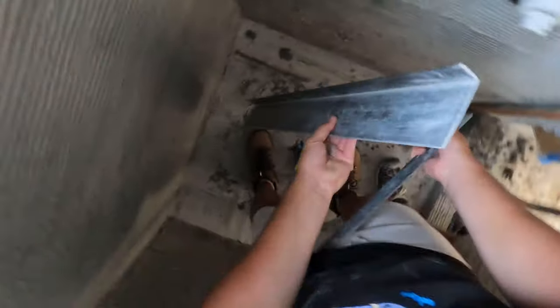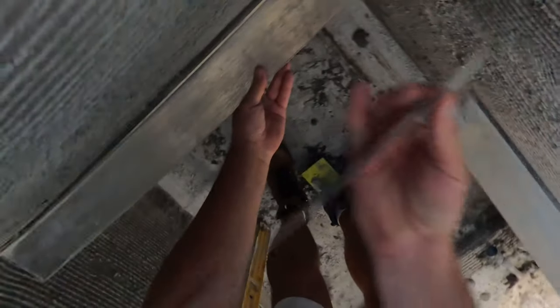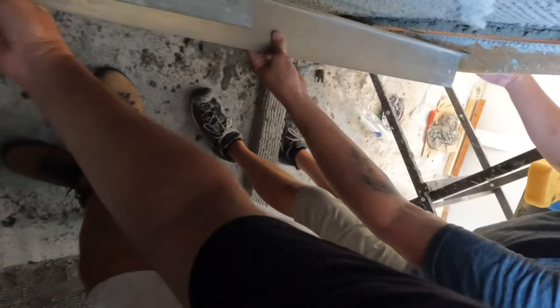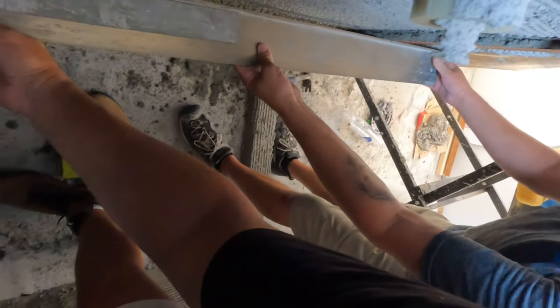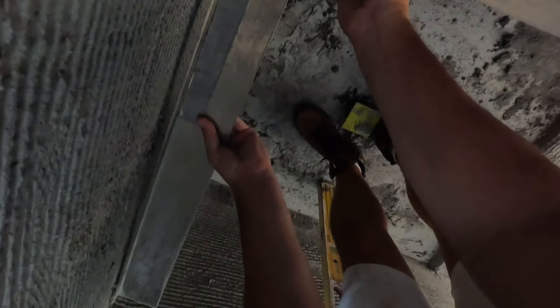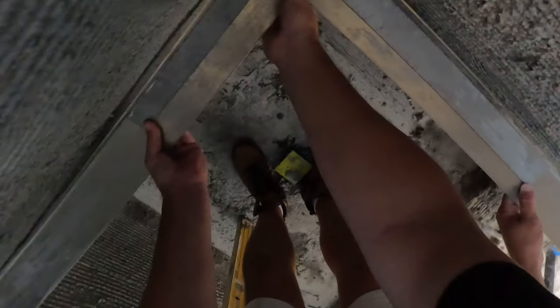What I want to do is check this with a straight edge, a square, and another straight edge, because I want to see if we build this out and stay more flush to this drywall here, what that does to this back wall. So we're going to check it real quick, see if we have to be tight out a little more, to make sure our square just keeps going around without this getting bigger and bigger. All right. Just put the squares tight up against the wall. Okay, so he's up against the stick there. Have to come out a bit.